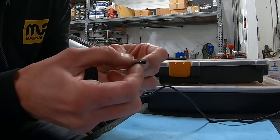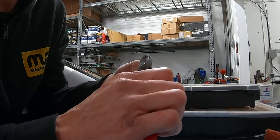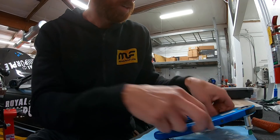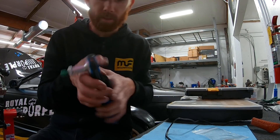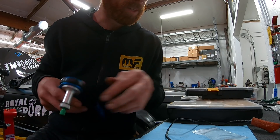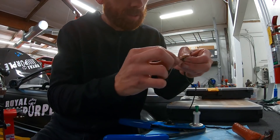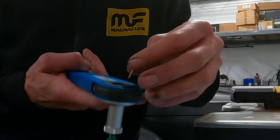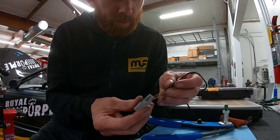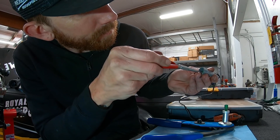First thing I do - cut this heat shrink back a little bit. This is me pretending like I know how to wire anything - I don't, so I have other people do my wiring for me, but they're not here! I use male pins and female connectors and female pins and male connectors. You can set your wire gauge - we're going to go down to 22. This actually will set the depth of the pin when you have the medium or large pins. Slide it in there, give it a squeeze, and once you squeeze it all the way it will release. Nice little pin. Pin slider in, squeeze and release. Then to put in the connector - super easy. Pins will pop right through, and this guy just pops right in there.